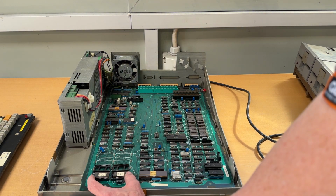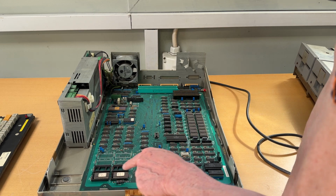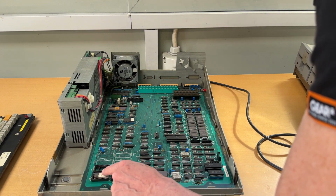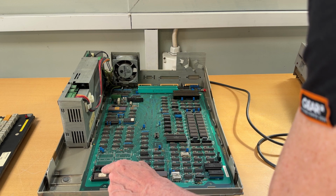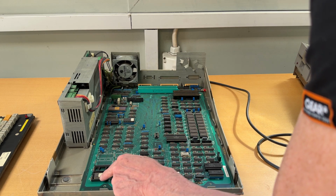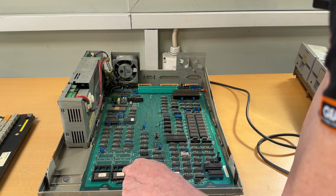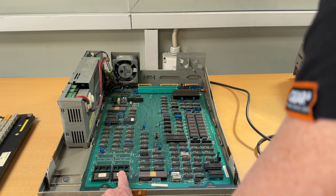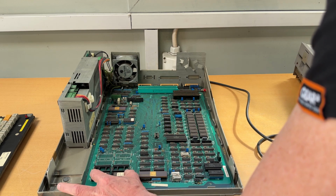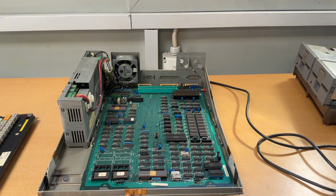We have 2 BIOS up here. I need to remove the BIOS. There's something scribbled on it. I almost can't read it. It's like DIB and I don't know, 0, H1, which must be, okay, so this is high, and this one says low. So this is the high and this is low. I will make a dump of that and put them on archive.org, so we have them for future use.